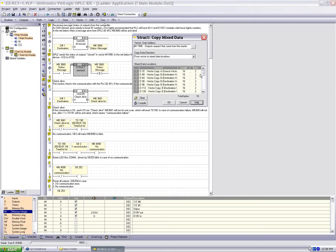This should make sense that we can do this by default, because if there is no output on the 570 side, all we're going to send is zeros. And if we're sending zeros to outputs, well, it doesn't really matter. So it's kind of a trick we're able to take advantage of to set up a program by default that's going to work with digital modules.